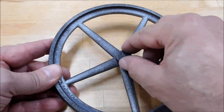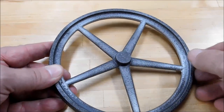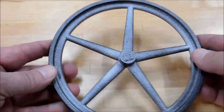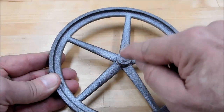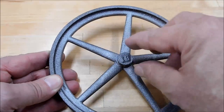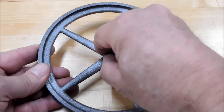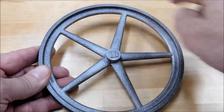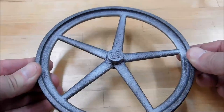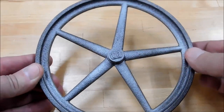Let's say this side is 30 thousandths out to where you want to be and your chuck only moves 20. Well, by grabbing here and shifting your chuck completely off center, you now have a 10 thousandths error on this side to what you want to have. So by returning the newly turned side back into the chuck, you can now finish dialing out an error that's greater than the adjustability of your chuck because you've reduced that error by turning a pilot diameter.